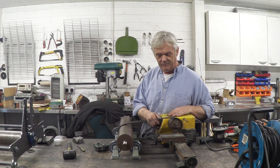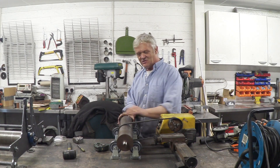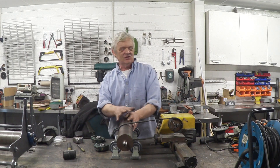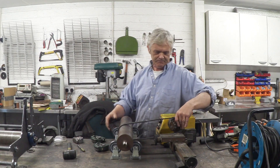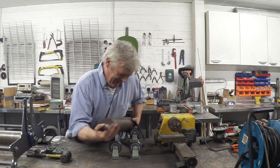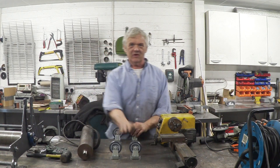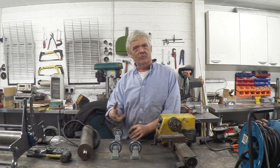Once you do that you're able to drive this directly. When we get that driving, what we've effectively done is extend the lathe, and suddenly we're able to turn this. Now this is turning, I can actually treat this as if it were part of my lathe. I've put this on some casters just fixed to the bench - four casters fixed to the bench - and the thing goes in there, and when we turn that around we can actually true it up or take it down.